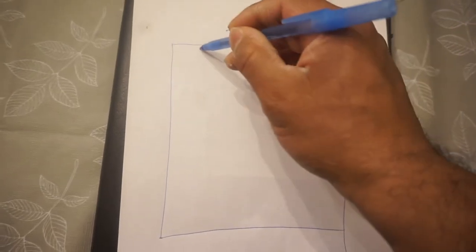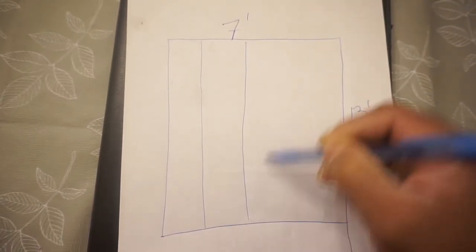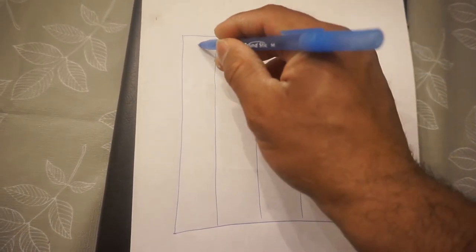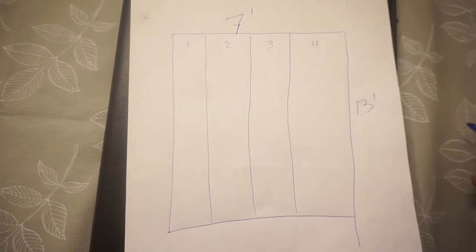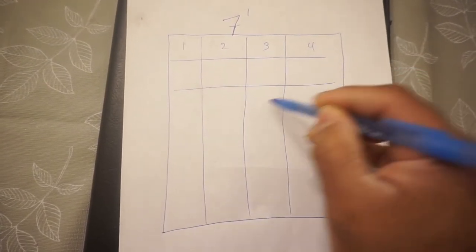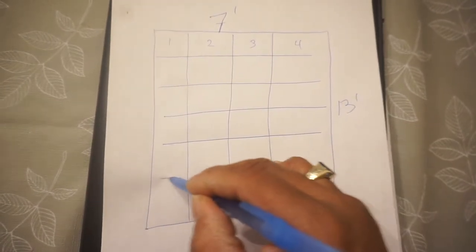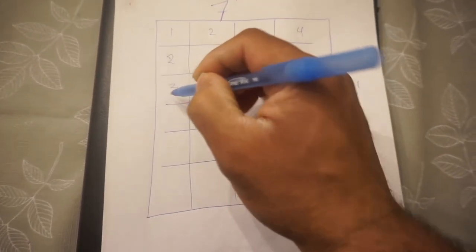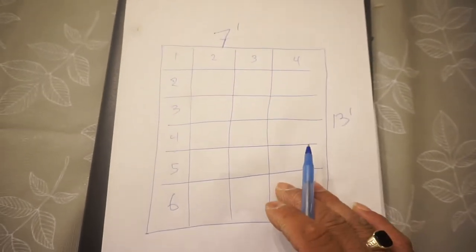So an important thing that you guys are going to have to know is that anytime you're laying out any type of wainscoting or accent wall, whatever it is you're putting on a wall, you want to make sure that all your boxes are relatively the same size. If you have a box that's maybe an inch bigger or a half inch bigger than the one beside it, the average eye is not gonna see that. So there's different ways that people can go about laying out walls.